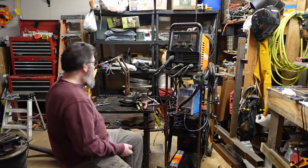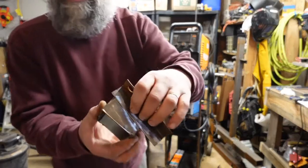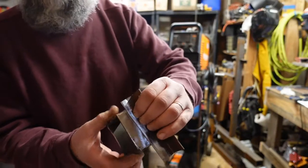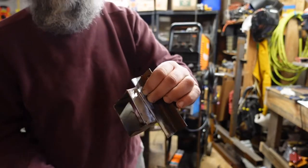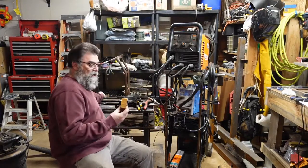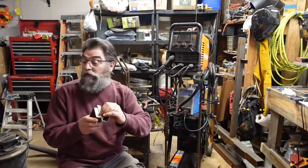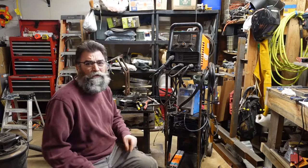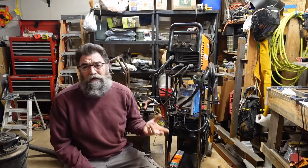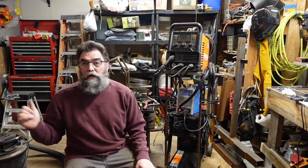Just some mild steel over here — I've got a couple pieces that I've cleaned up nicely. As you can see, they're all nice and shiny. Just cheap mild steel. I'm going to weld that together first with the flux core. I've got another identical piece that I will then do using the shielded gas, and we'll see what the difference is. Flux core is really dirty — there's the flux — a lot of clean up, a lot of splatter. I'm hoping not to get as much with the gas.